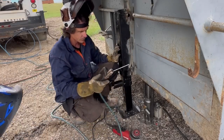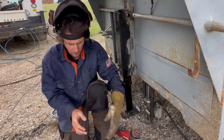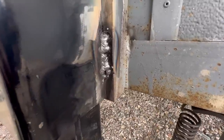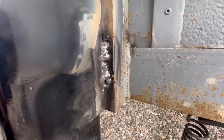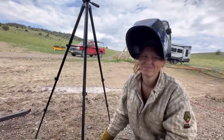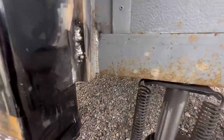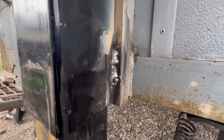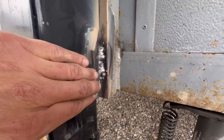All right. Well, let's actually, before we cap it, let's show everybody your weld. Because that's a pretty good first 70-18 uphill. So this is Emily's very first 70-18 uphill. She's never ran 70-18 uphill. She's only ran it in a flat horizontal position. So it's pretty good. I know all the old timers will appreciate that. You young kids don't know the difference. So that's her very first one. And that's 10 years of experience. Now, again, this is the rock mount rod. This is 70-18 over here. So I would say that's pretty good for her first one. But I'm gonna cap over it just to show her what she did wrong.